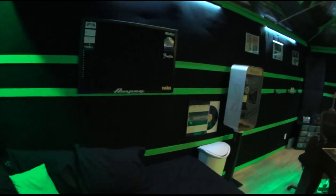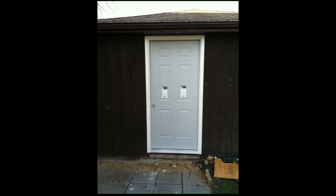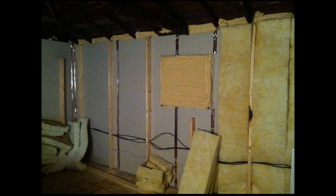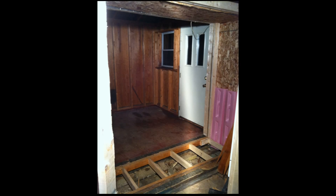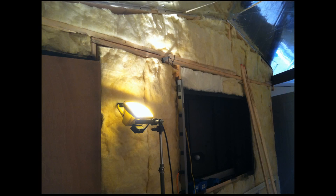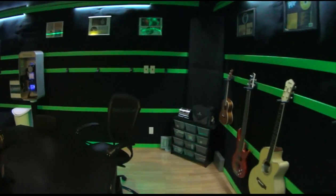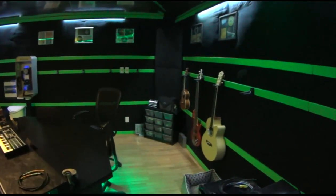The walls are a very big spot for leakage of sound. On the very outside is decorative half-inch plywood with green glue in between, sandwiched on top of another half-inch of plywood. That is nailed through half-inch foam core board into the studs that support the structure. All the cavities are then filled with spray foam and covered with half-inch drywall. Then we put green glue on that drywall, put a second set of studs and a second sheet of drywall, green glued and stuck that up. What this left us is a drywall with studs on the outside that we filled with acoustic insulation and covered with black fabric.